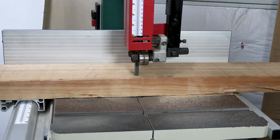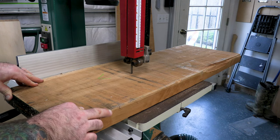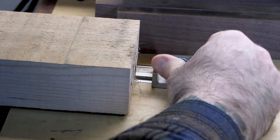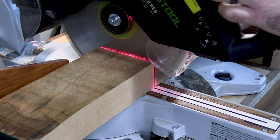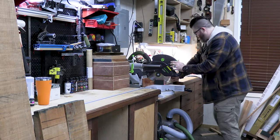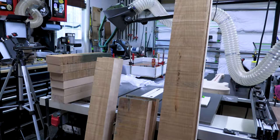With a two-day cure ahead of it, it was time to start working on the legs. In a small garage shop you have to get creative with space — these are almost eight-foot-long boards and it takes a lot of wrangling. I prefer to rough cut boards on the bandsaw first and then head to the miter saw. I'm using eight-quarter cherry for all of this. After rough milling, I let everything sit in the shop for a day or two to see if things move, since boards up to 12 inches wide do shift a bit.